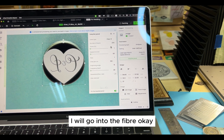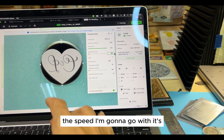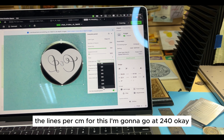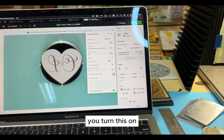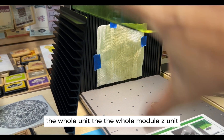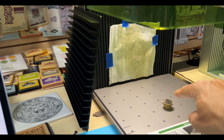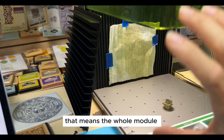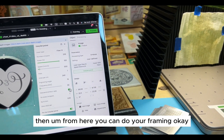Come into the easy panel, go into fiber. There are 256 layers. The power is 100%, the speed is 500mm per second, the lines per centimeter I'm going to set at 240, the engraving angle is 15, and the frequency you just leave at 30. Make sure to check the Z-axis and turn it on — the reason is that while engraving downwards, the Z unit, meaning the whole module, will slightly move down in order to stay focused on the stamp and engrave deep inside the brass.